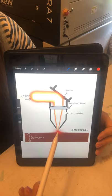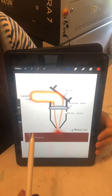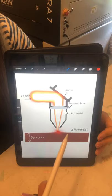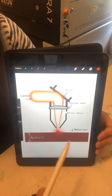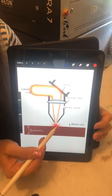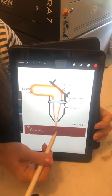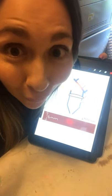This is the strongest part of the beam. When you're engraving, you definitely want to have that strongest part of the beam on the surface of your material. For the purpose of this diagram, we're going to pretend we're working with a quarter inch — about six millimeters — material. But what if you could get the strongest part of the beam not on the surface when you're cutting, but push it down so that it hits the center instead?